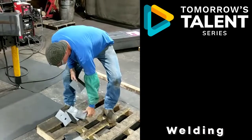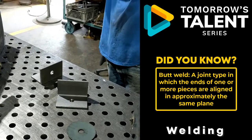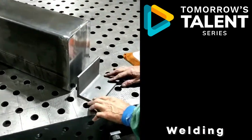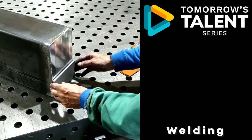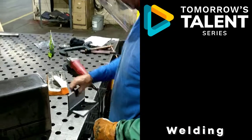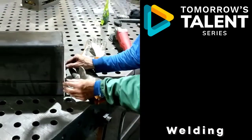These are the two feet that I've been putting on it. I'm going to chamfer one edge — that will give you a pretty slide. This time it's a butt weld. Anytime you have a butt weld, you're probably going to want to put a chamfer on it, especially if it gets ground back off. You want to have penetration down deep in there. This is going to sit on the end — just like that. Notice: no grind marks, no gouging. It's nice and flat, nice and even. Put it on there and flush it up. Now you'll see — this is what's called a butt weld. The two sides are evenly matched — we don't want that. There's your chamfer. I'm going to put it on there; it's going to lay up against there. Now you have a gap for your weld to get inside. When you sand it off, you don't have to worry about cracking.